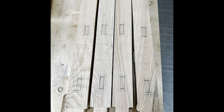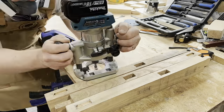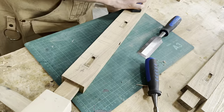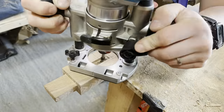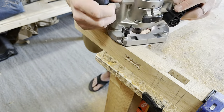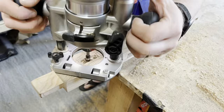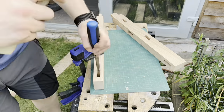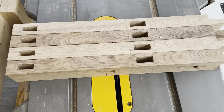After I'd done that I needed to mark out all the rest of the mortises to get them cut out, because these would form the basis for the cross braces that connected both sides up. I marked them all out, took out some of the waste so it was nice and profiled, then just used the router to flush trim down and that gave me a nice square clean cut all the way through. Once I'd finished cutting the bulk of it out I then used a little chisel to take off all the rounded corners so they're nice and sharp for when the cross braces went through them.